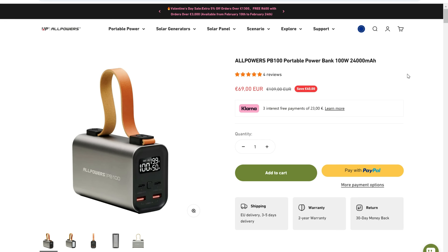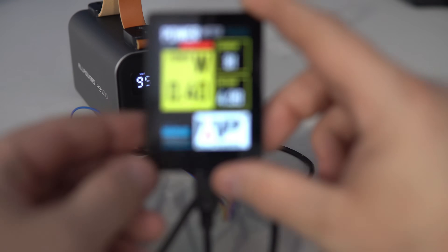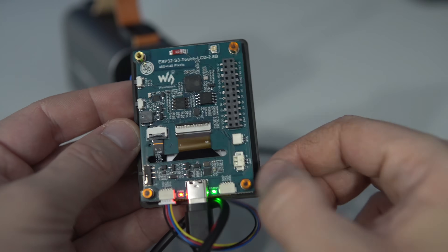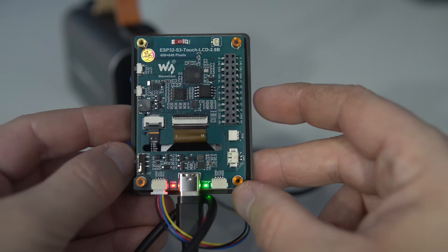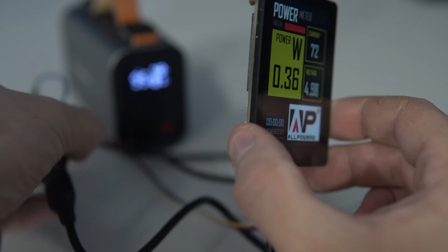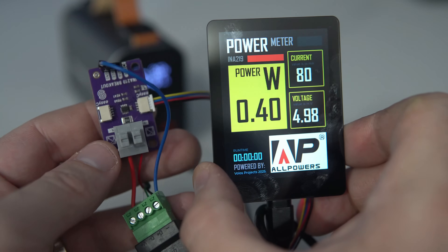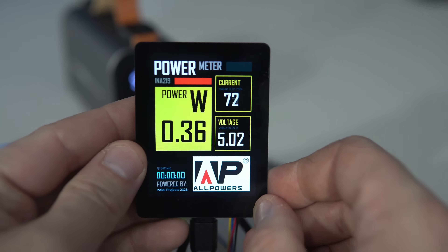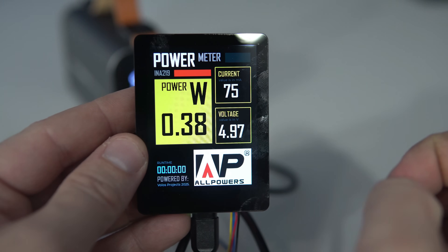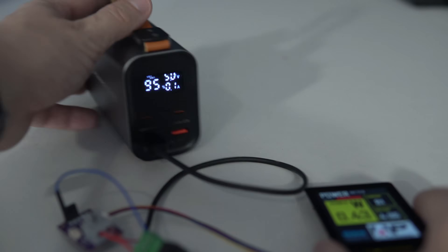Let's play with our ESP32 boards and power banks. Here is a project I made for this video — this is the beautiful Waveshare 2.8 board. It has a touchscreen, buzzer, real-time clock chip, SD card slot, and a beautiful 480 by 640 display. I also have a module which measures voltage and current so we can get power readings — this is the INA219 — and we can see that this board is currently consuming 77 milliamps.